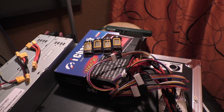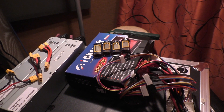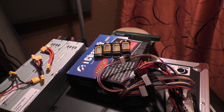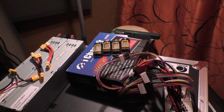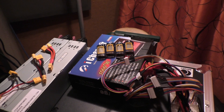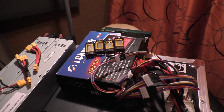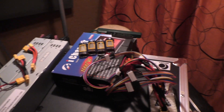This is working out really well so far. Range is about 18 to 20 miles at this exact setup, going from 4.17 down to 3.6 volts. That's with hills — I live in Portland, Oregon, so I'm up and down and all over the place. I took three bike rides yesterday and put a lot of miles on.